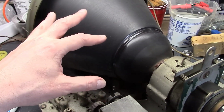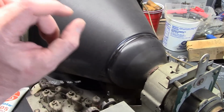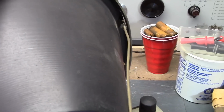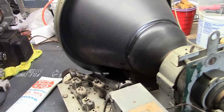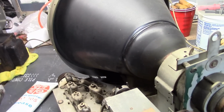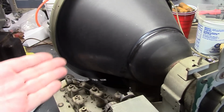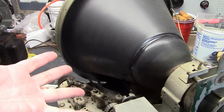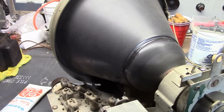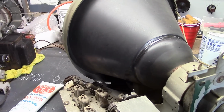I've busted these open. It's not super thick, but not real thin either. I think maybe, I'm looking at the lip here, you can get some idea. It's maybe a 1/16 of an inch thick. But it's certainly lighter weight than glass. That's why they used these. The whole picture tube probably weighs half or less than an all-glass version would. It also allowed them to make bigger picture tubes, I believe, more easily, all the way up to the gigantic 30-inch Dumont CRT, also metal cone.